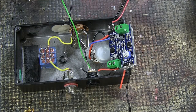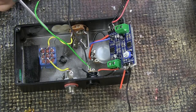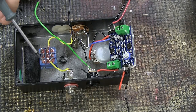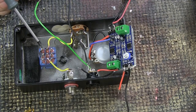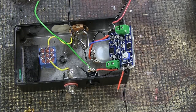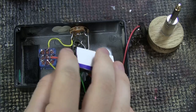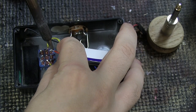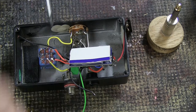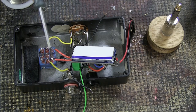To explain what's happening: the signal comes in through the input jack. When you press the switch you select either the lower row or the upper row. On the lower row I have a jumper cable from the first leg to the third leg, leaving the middle leg alone — that's the bypass path. You need to solder that jumper on the lower row. The in from the PCB connects to the upper row's input and the out connects to the upper row's output. So the switch just chooses between the direct bypass cable or routing through the whole PCB circuit.